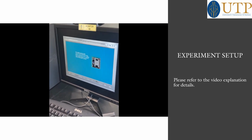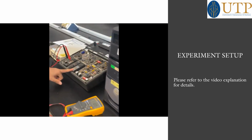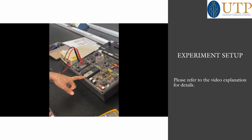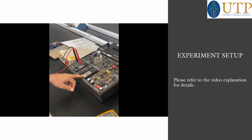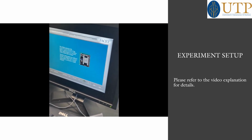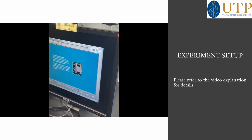Next is the variable capacitance sensor, which is another circuit block. The variable capacitance sensor is a circuit block connected to an RC oscillator, whose output frequency is a function of the movable plate's position. The block demonstrates how additional circuitry can change one transducer output into another. In this case, a variable capacitance is converted to a variable frequency.